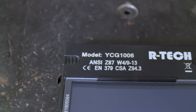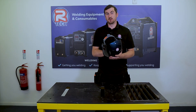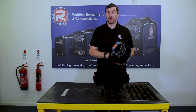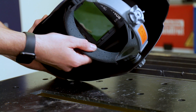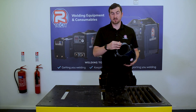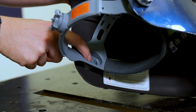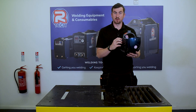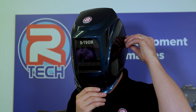It's powered by your solar cell on the front and two internal Li batteries which can be replaced — they just pop out easily and are your flat or round type. We estimate those to last around 6,000 hours, so really good battery life. Above the self-check button there is a low battery indicator — if that ever illuminates, your batteries are running low. There's full headgear adjustment with a padded front for your forehead, upper size adjustment, and a rear dial you push in and move left to right to loosen and tighten. The dial on the side is important — loosening it fully adjusts how close or far from your face the mask sits, and the tension differs how the mask reacts on your head. Tighten it right down and you have to physically move the mask; loosen it right off and it stays down; in the middle a nod of the head brings it down nicely. Personal preference.